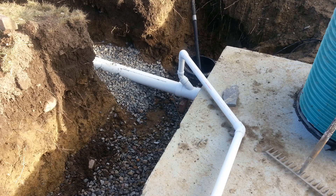On the list we talked about a 4x4 by inch and a half T or Y to be used for the building sewer inlet. The gravity return line from the hydraulic unit needs to work its way back to the front of the septic tank. We find it's best if it can be tied directly into the 4 inch sewer line so that another knockout need not be put into the septic tank. One less pipe penetration means a better chance for the tank to remain watertight throughout its life.